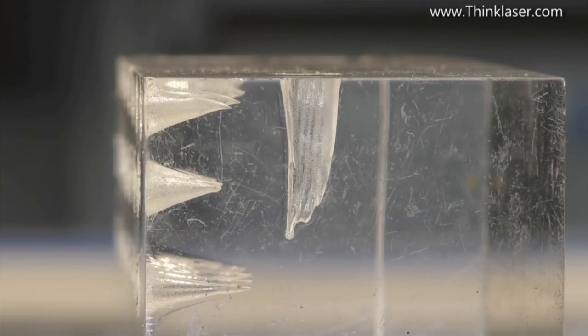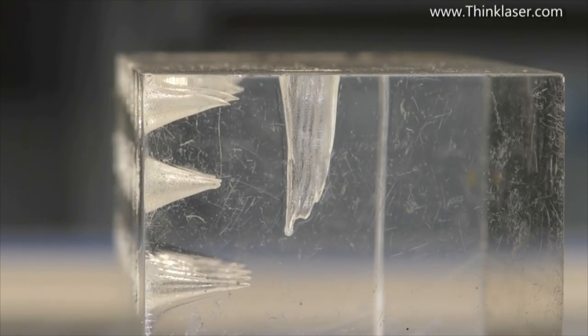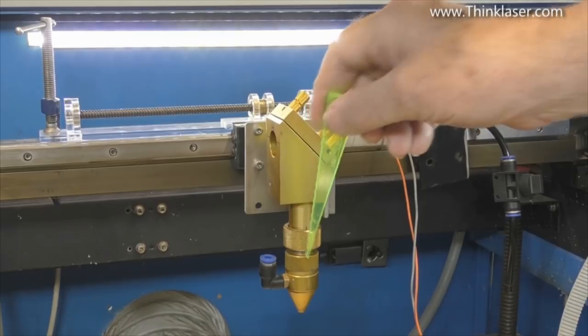This is a great demonstration of how striations can be formed with a pulsing mechanism. Pulsing could either be a stepper motor edging forward - which is basically what I've simulated here - or if you've got a professional machine which uses an RF tube, they have control of the pulse frequency. Even with silky smooth DC motors, the pulsing of the laser beam itself can cause exactly the same problem. They overcome it by changing the frequency to very high frequencies so the pulses become so fast you don't see the striations.